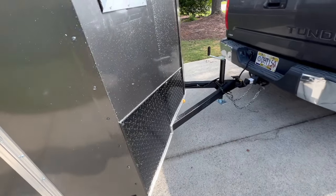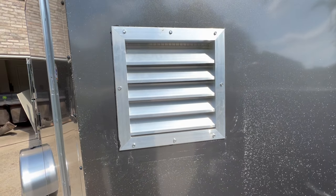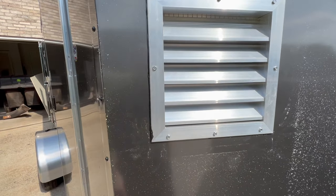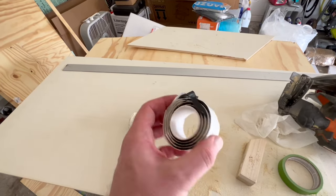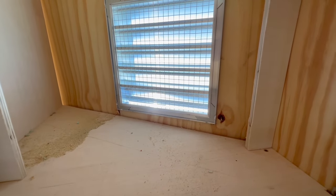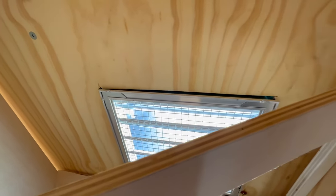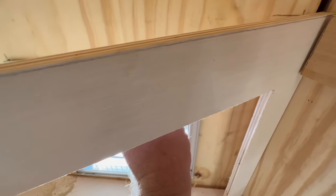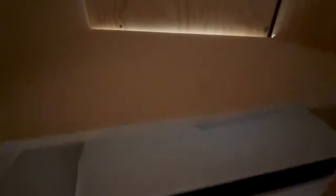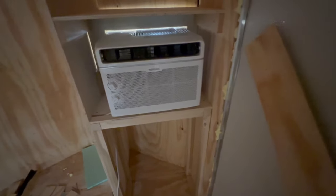There was also a huge mistake in here which you'll see as well. The first thing I did was cut a hole in the front of the trailer — pretty nerve-wracking — and put in this 12 by 12 louvered aluminum vent, screwed onto the aluminum skin. Around the edges I used some black butyl tape to seal it off from rain. The basic design has the rear of the AC sitting back towards the louver, exhausting hot air out the front through the larger vent, while pulling fresh air in from the side.